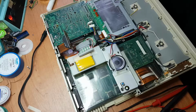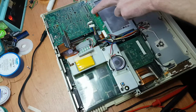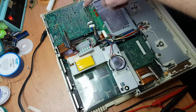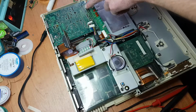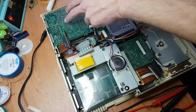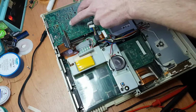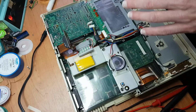But I was thinking, these things have voltage dividers, which go to some of the resistors over here, and those feed the signals back into the analog inputs of the 2 microcontrollers. And those only tolerate 5 volts, so there should be 5 volt signals derived from the voltage on the 5-volt and the main power rails. And those should be 5 volts, more or less.